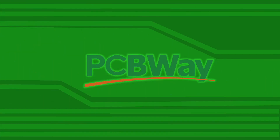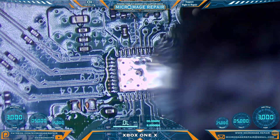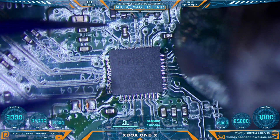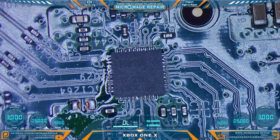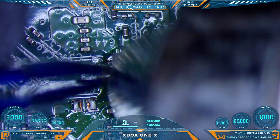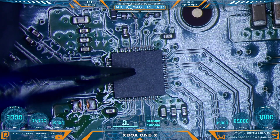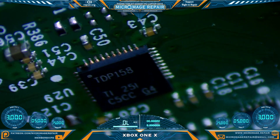The board is still warm. I'm going to rewet that solder — we're watching for the center pad to wet, so we need to grab onto our IC. Make sure it has grabbed on before you let go of the IC, otherwise you will blow it away. Once you've centered it, remove the heat, let it tack down, push down, and wet one more time. Don't push down too hard.